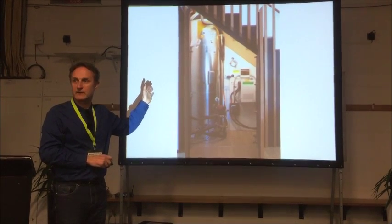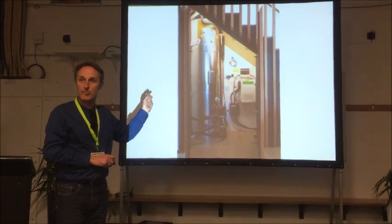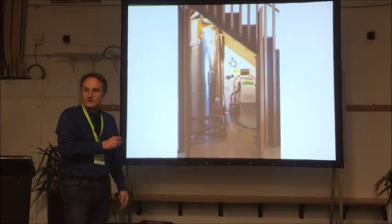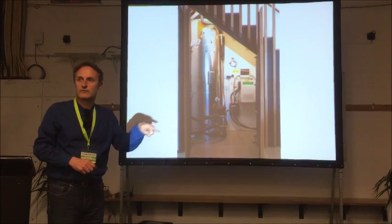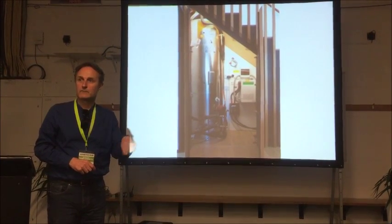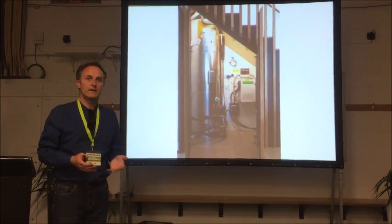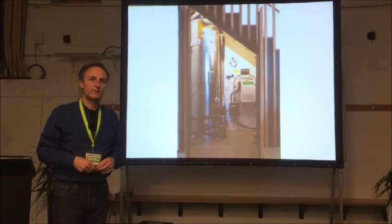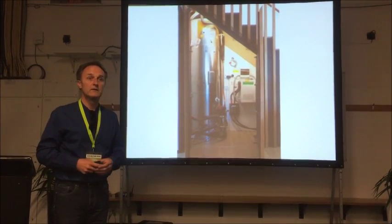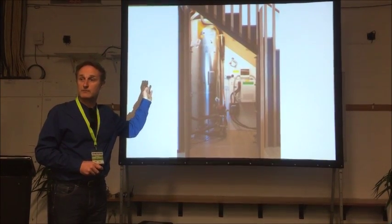The cylinder is twice as big as it needs to be, so we use it as a heat sink. Water is a really good storage medium for heating energy. A pump at the bottom pumps the water through the floor if the thermostat indicates space heating is required — through our hydronic underfloor heating system. Because we've fully insulated the floor, I really see that floor as a battery. We're storing solar energy in the floor indirectly, and also the hot water cylinder — that's a battery too.